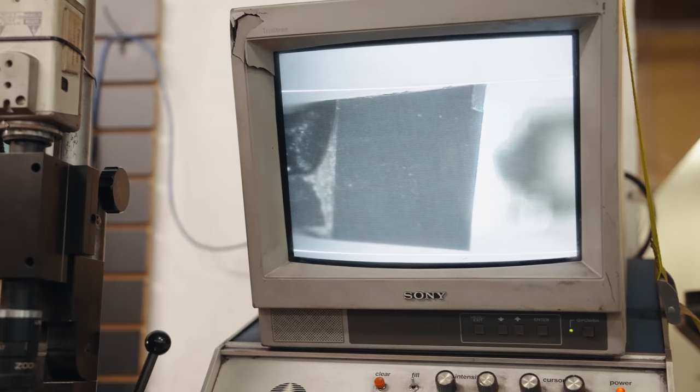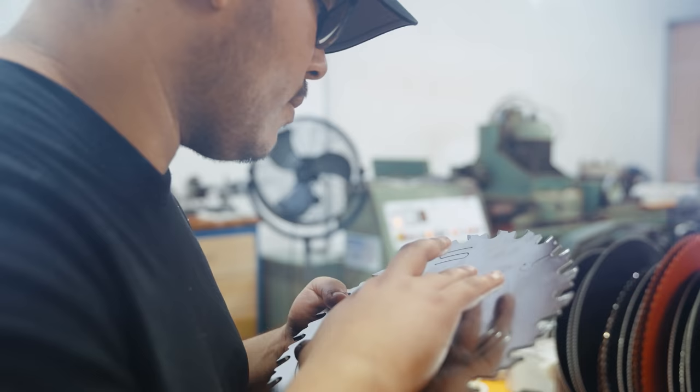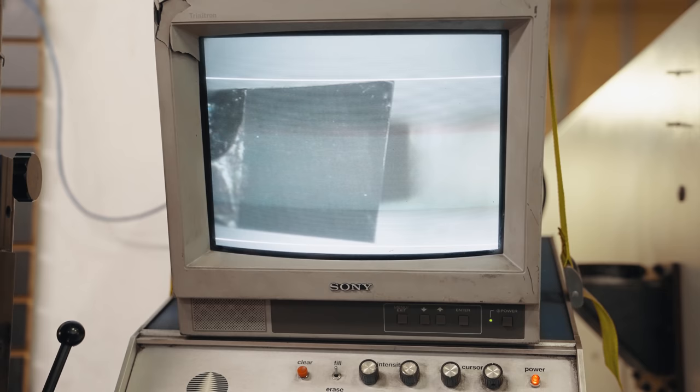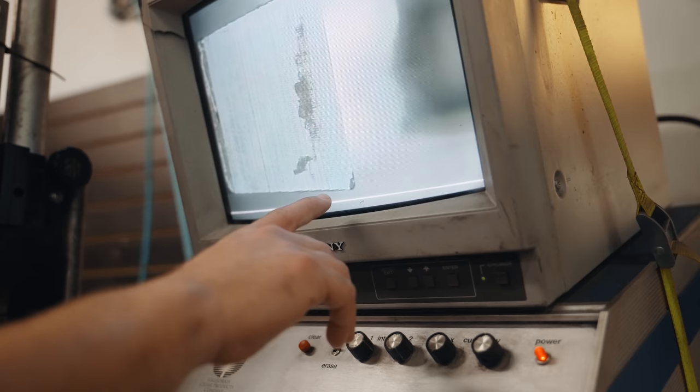We're going to go through and quickly see — first thing we found is a chipped tooth. Look at that. We look for things like that so we can make sure when we sharpen it, we take the right amount off. A lot of times this is done visually, not with the camera system, but the camera can verify that. There's a bad tooth — you can see that corner. That's the sort of thing that makes a blade dull. These blades are in really good shape, but there are some minor imperfections causing dullness. This blade's ready for sharpening.